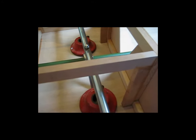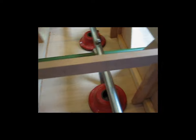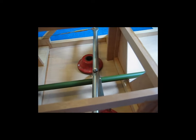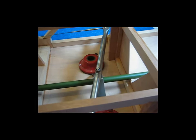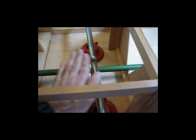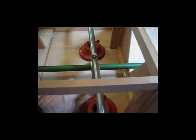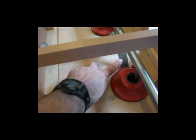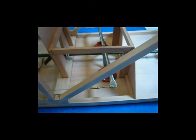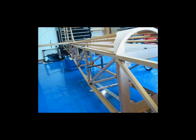When I put tension on the cables, it will draw this back a little bit and prevent the rudder from hitting. I can move the rudder bar forward or backward so the bar hits this stop just as the rudder in the back is reaching its full throw. I'm swinging this around, checking stop positions and rudder travel relative to the elevators, then I'll shift the bar as needed, confirm it's square and in alignment, and mark the mounting holes underneath for both sides.